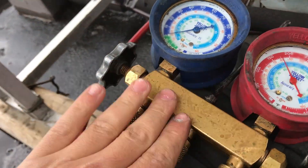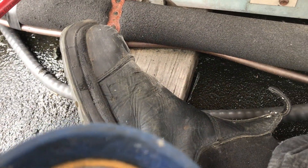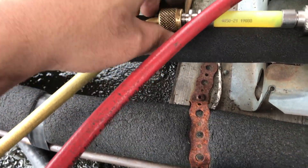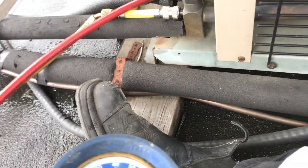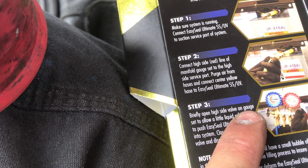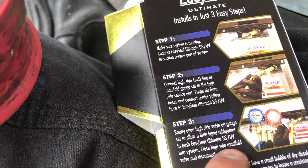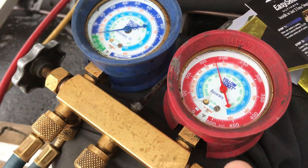I'm using my old school manifold, not my Testo, because I hate putting dye through my manifold — it messed up my Testo. I'm going to check that. Make sure my hand valve is closed. Now, step three: briefly open the high side valve on the gauge set to allow liquid refrigerant to push the easy seal through the system, then close the high side manifold and disconnect. As you guys can see, in here there's the UV dye. I'm going to open up my valve — high side — and push it through to my low side. Let's see what happens.